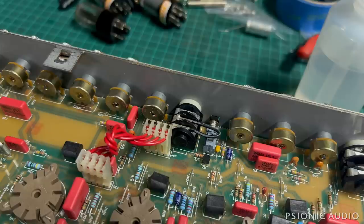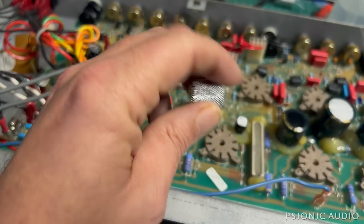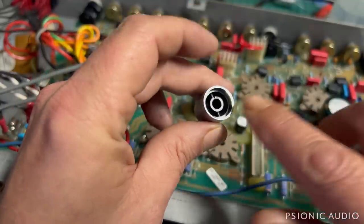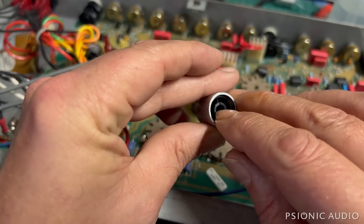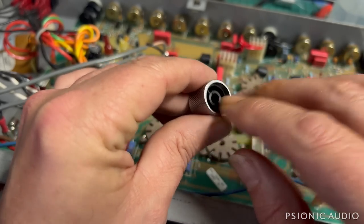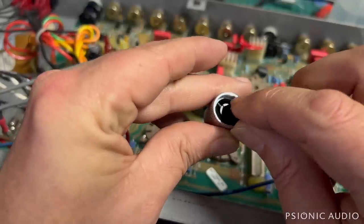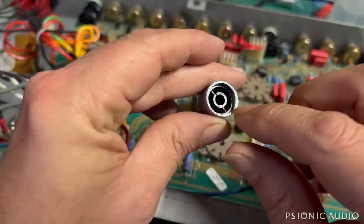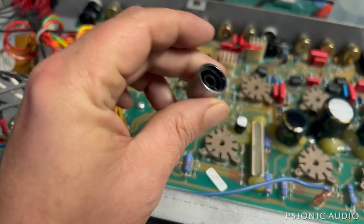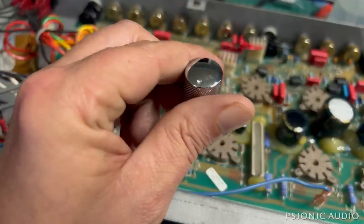I'm going to hook this up to my cab and power it on with the current limiter to see what sounds we get and if anything wants to go boom. Right before I power it on — earlier I said there's a missing knob. I found it on the floor. This is very common with Ampeg and Crate knobs from this era. They're plastic painted with a thin coating of metal, and the inside is a press-on to the knurled shaft — and it just breaks. The fix, if you don't want to order another one, is to super glue it together and then put some masking tape on the plastic shaft and push it back on. Usually it stays well enough.